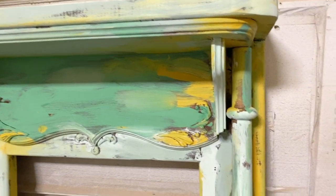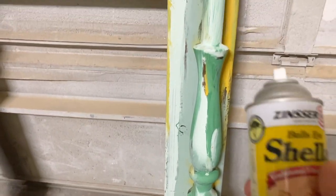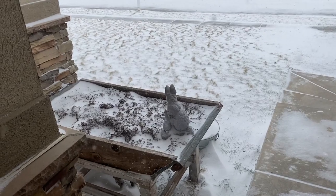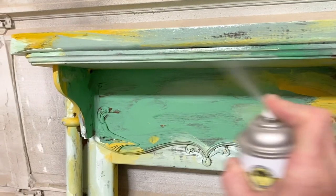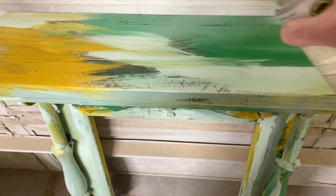Our mishmash of all the different colors is dry and I'm just going to be spraying on some Zinsser Shellac to create a resist. It's cold and snowing outside, and we're hoping to get some good crackle when we put the milk paint over this. I'm not going for full coverage — I'm just going to spray it in a few spots so that where we get the resistant crackle it'll look natural, like it just happened randomly.